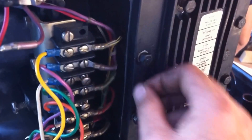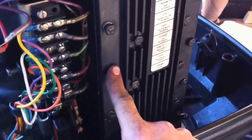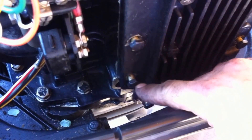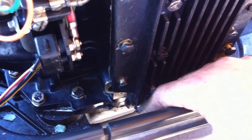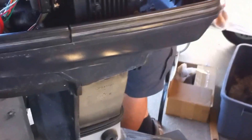I'm just throwing on the exhaust cover port here and I'm going to tighten these. I couldn't find the specific torque spec, but the standard measurement was 70 inch pounds. I've got all the screws here and I'm going to cover them. I should have put this on before I dropped it down onto the leg, because I can't even fit my torque wrench down here — it won't fit in here to get the right torque on these lower ones. Just the cowlings anyway.